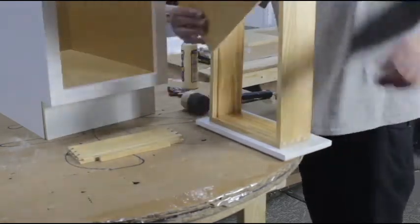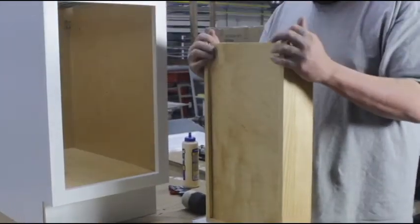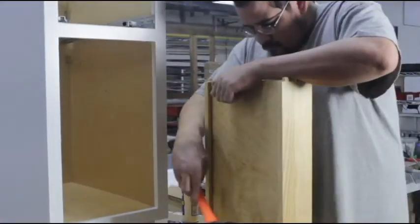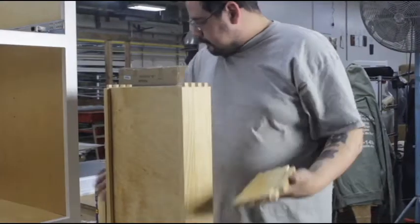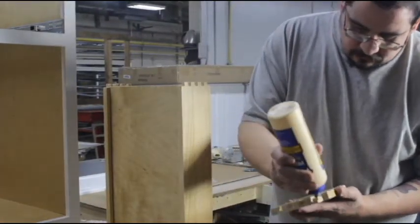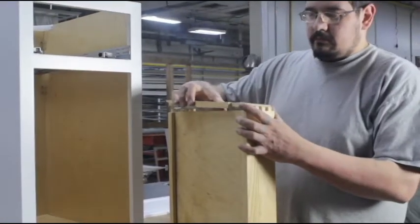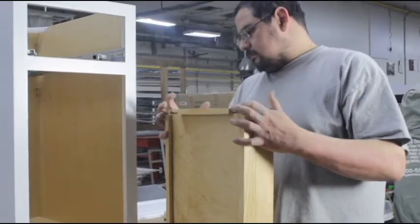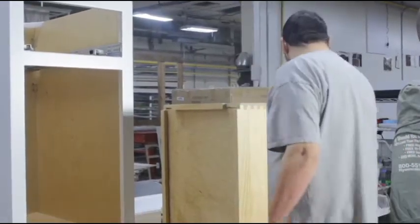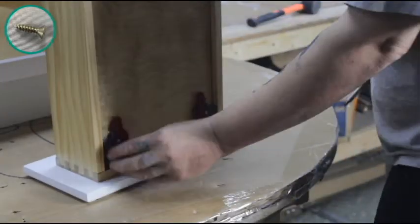Slide the drawer floor into the parallel grooves on the inside of the drawer. Make sure it fits into the groove on the drawer front. Place the drawer back, notch side down, teeth inward between the left and right sides of the drawer walls. Now take your drawer connectors and put them in the corners of your drawer and fasten them down.